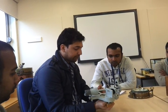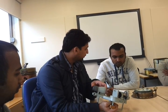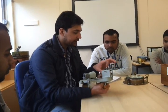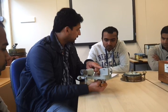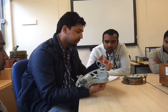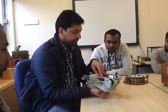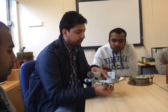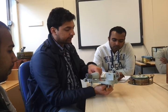Okay, this is the micrometer drum. Okay, this will be the eyepiece and this will be the telescope. These are your horizon glass shades, and these are your index mirror shades. Okay, this is the horizon glass, this is the index mirror. Okay, this is the adjustment screw for your index mirror, and this will be the adjustment screws for your horizon glass. Okay, this is the graduated arc. Okay, and this will be the plane of the sextant. This is your pivot point, this point where the pivot is there, the index arm is there, so that will be your pivot point, and this will be your index arm.